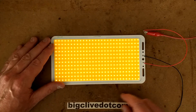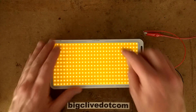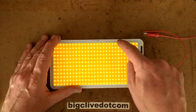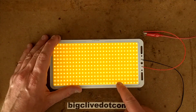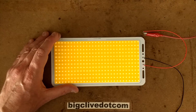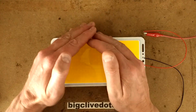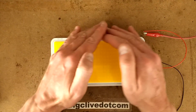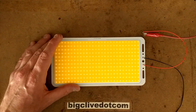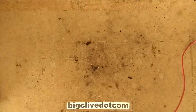There is one slightly dominant column of chips here. I'm guessing the circuit board is going through this way and the pick-and-place machines feed it from a series of reels and rows. This row here is very slightly prominent, and that happens even at the lower intensities where you can see it even more. Turning it down to the point it's just barely lit — all the chips are illuminated at roughly an even level. There are no chips out, so it seems to be made with fairly good quality LEDs.